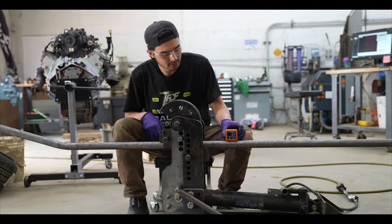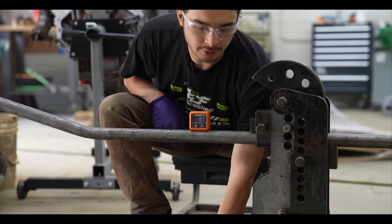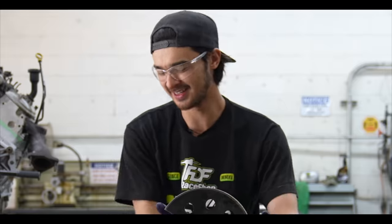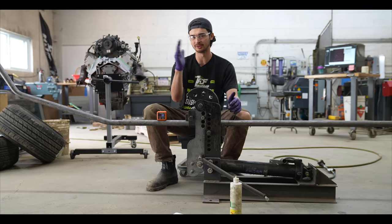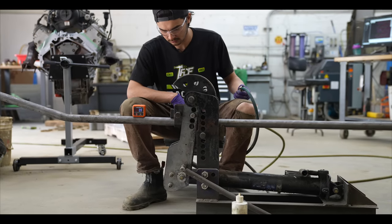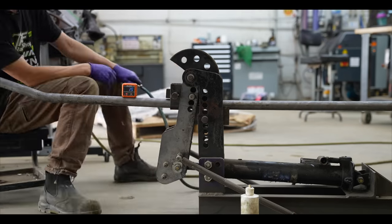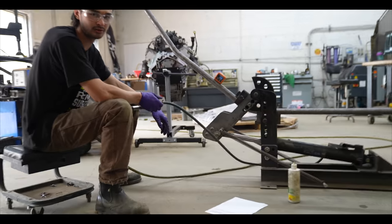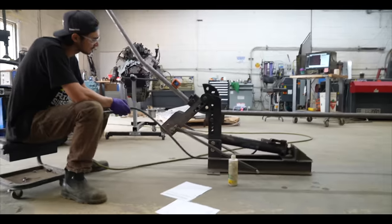Using my angle finder I'm finding zero — it's at about 0.2 degrees — and then I want this part of the tube at 38 degrees. Chromoly tubing has spring-back when you bend it, like most high tensile strength metals, so it'll spring back a couple degrees. I'm going to bend it to 40 or 41 and hopefully it springs back to 38. I said two degrees but it's usually not enough.